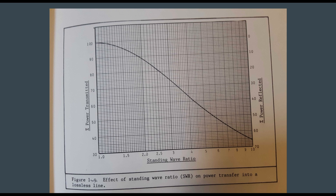One, power is absorbed and dissipated as heat via ohmic resistance — power came in, the antenna got hot, and it turned into heat. The rest is what's called radiation resistance, which is how much of your signal is converted. An antenna is called a transducer because it takes the RF current coming in off the wire and turns it into RF energy in space. Your radiated power is what goes out into space.